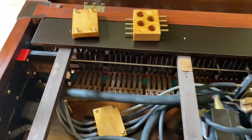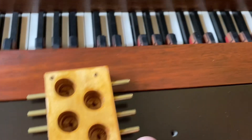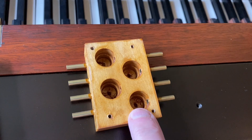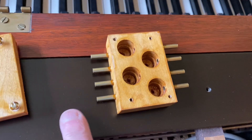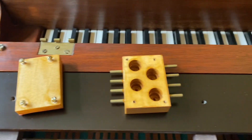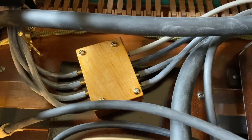So I thought it would be smart to build a little filter. It's a very simple design — you have four nipples on this side coming in, they come in on top, there's a little shoulder where a fine stainless steel mesh screen goes down in there, which filters the air, and then they continue on out to the tracking device. That way you can just take the cover off and vacuum it out, rather than having to completely disassemble the tracking device to get all the gunk out of there.